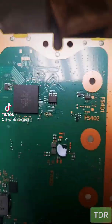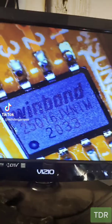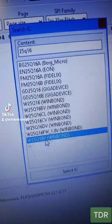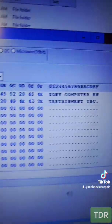Let's remove this firmware chip and read it — I'm suspecting that's the problem. So I removed the chip here, soldered it to the board, and let's attach it to the reader. We want to read it but it's not being identified. I have to look up the specs manually. The closest one would be this one here, so let's select it. It would help if I put the chip on. Voila — we have Sony Entertainment.